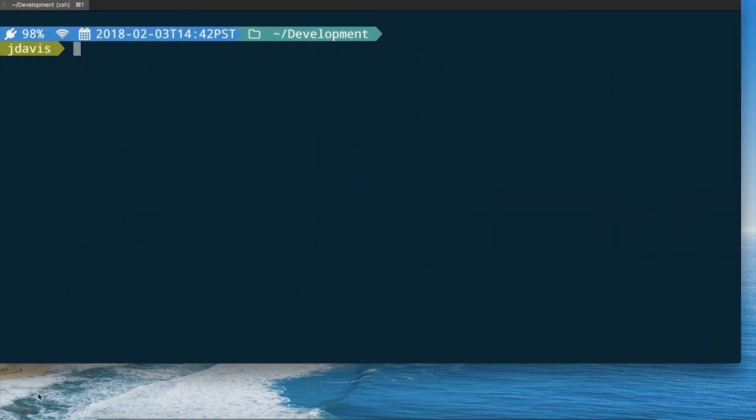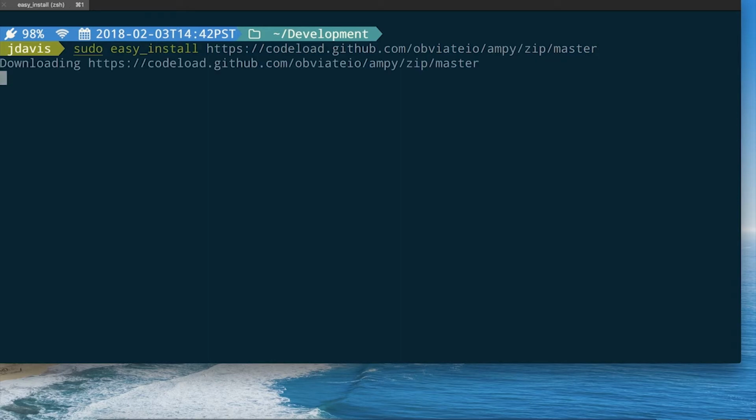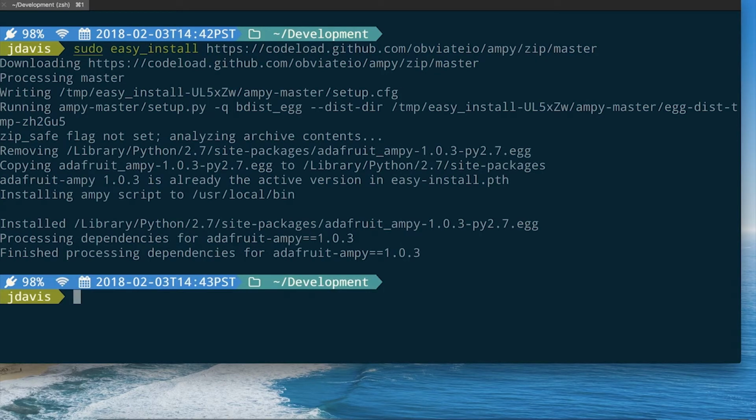So on to business. As usual, we have prerequisites to address. The first is to install the modified version of Ampy. You'll want to run easy_install with the URL shown both on screen and in the description. My modifications to the original library are minimal, just enough to get functionality with the D1, and that's the only ESP8266 chip I've tested with. If you're working with another, it may work, or you might try the original copy of Ampy by Adafruit, which is also linked. They have code tuned to work best with Adafruit hardware.